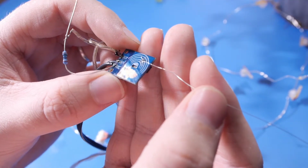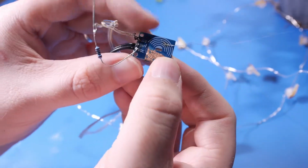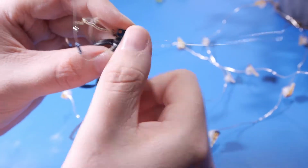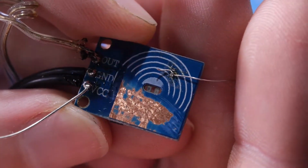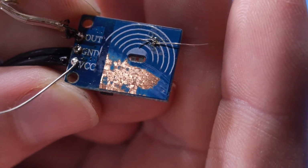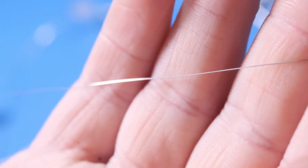What I've done here is I've got one of these little touch modules I got on eBay or AliExpress or something. It's just a capacitive touch button, and originally it had just a little pad here to touch, so you'd put that, I don't know, on a piece of metal or something and you could touch it. And what I did, there was a little via there, however you pronounce it, that connects to this touch panel here, and all I did was scratch it back and install a piece of 30 gauge wire. It's just wrapping wire. I stripped it back, and thankfully it works just by touching anywhere on the wire.